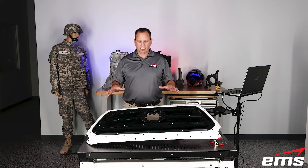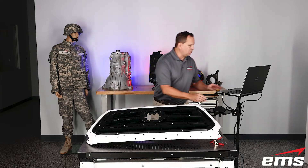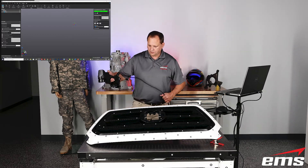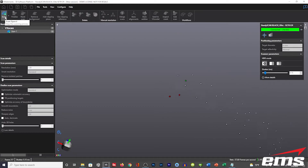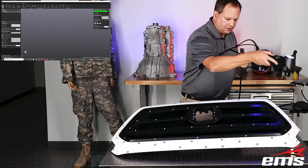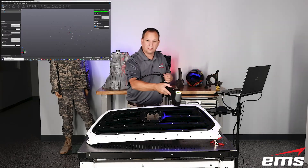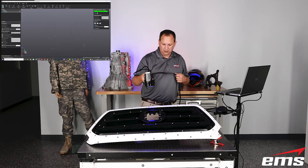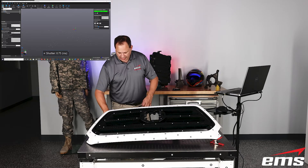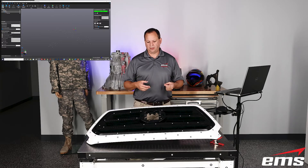And again, this is all about speed. We can do this very, very quickly as opposed to trying to 3D scan the whole part and load in a huge scan file. We've set up a new session because we've exported the original file. And scanning targets is extremely fast — you just kind of move around, the lasers don't come on, it's just the LEDs and the cameras picking it up. Having these targets in specific locations lets me see what I'm looking for — the different surfaces I'm interested in. We only really need targets on surfaces we care about. Then I stop, and next we'll go into the software and look at the two different files to see where some of the deviation is.